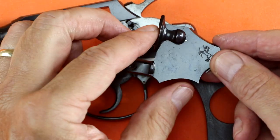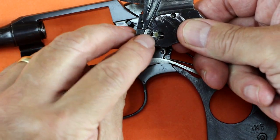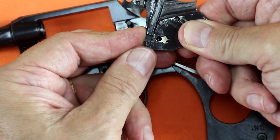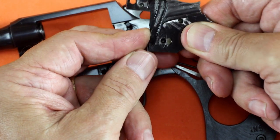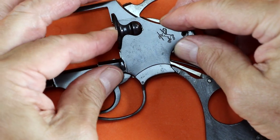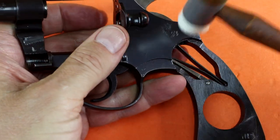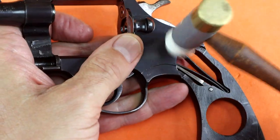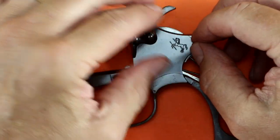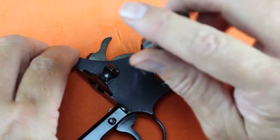The latch is fitted to the side plate. Note that on the back of the latch there's a hole that has to be fit over the latch pin when the side plate is fitted to the frame. The side plate is pressed in place and a few light taps of a plastic hammer should be all it takes to get a nice flush fit. The two side plate screws, when firmly fastened with the proper screwdriver, will hold the side plate in place.